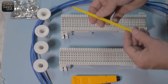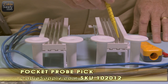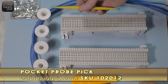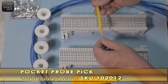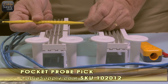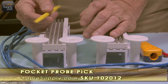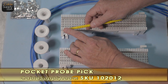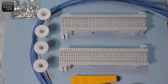First, what I have here is a pick. This pick is used for when you're pulling cable up — you really have a hard time getting the cable if it's punched down wrong. One end is metal; you don't use that if you have electricity going through the cable. The other end is plastic, so it's completely safe to use even on a live circuit.